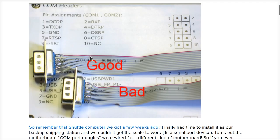And those of you that may have tried it would notice that the rubber insulation on ribbon cables is not Teflon. This stuff melts so easily and runs all over. I mean, yeah, I've made cables like this before. No, you don't want to do this. This is probably some sort of PVC or vinyl, which is also toxic if you inhale the fumes as it melts. I mean, this is so bad, so wrong in every way. It just shows a complete lack of respect for humanity.